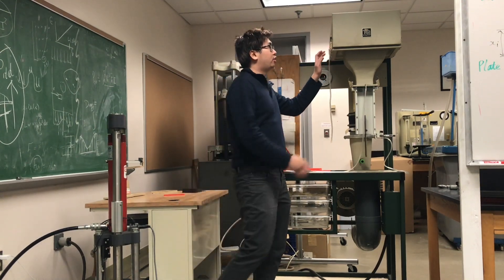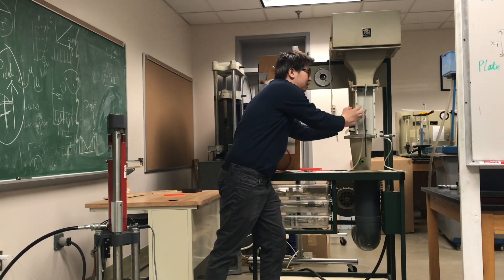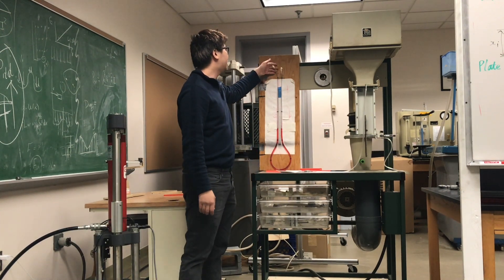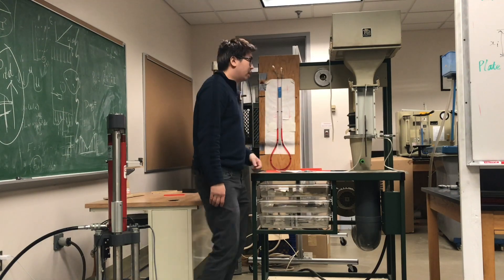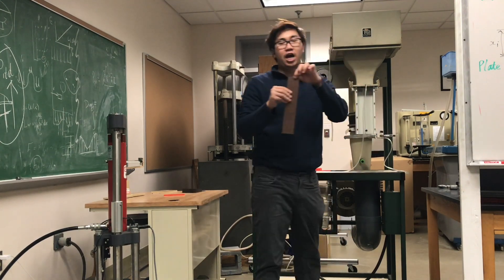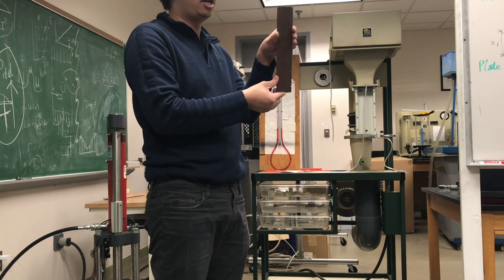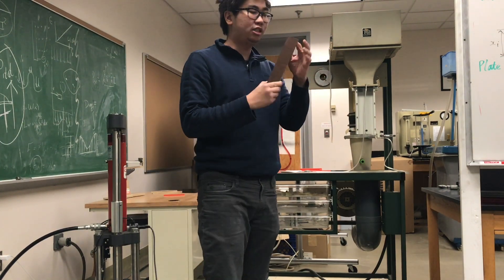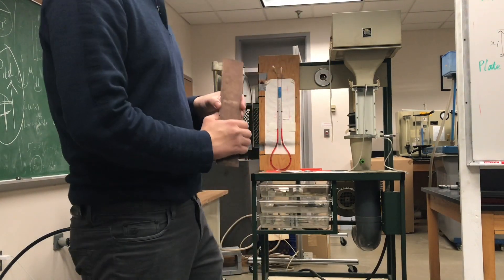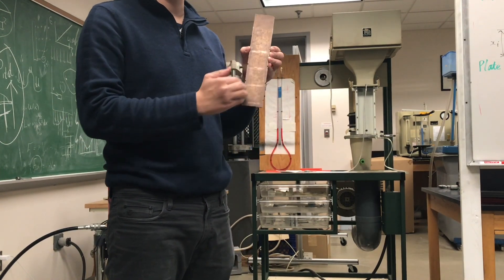This is our air bench — this is the tank section, and this is the inlet part of the air bench. This right here is the manometer, which can be used to measure pressure. This is the flat plate: this sharp end is the leading edge and the other side is the trailing edge. In this plate we have four notches, because we want to measure the boundary layer thickness at four different locations.